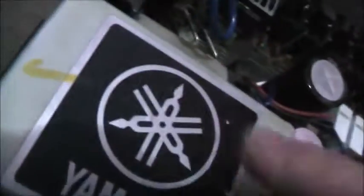Oh, I scratched the transfer label. Crap. The fault is in this part of the circuit somewhere. Might be these transistors, because these lower 4 resistors get a bit hot after a while. This doesn't get hot anymore. This gets hot only when I plug this in. So this circuit is driving something that's shorted. So I reckon one of these is gone. Disconnecting this part of the circuit board here, from here down, it powers up. So I managed to track the fault down, that makes it a lot easier.